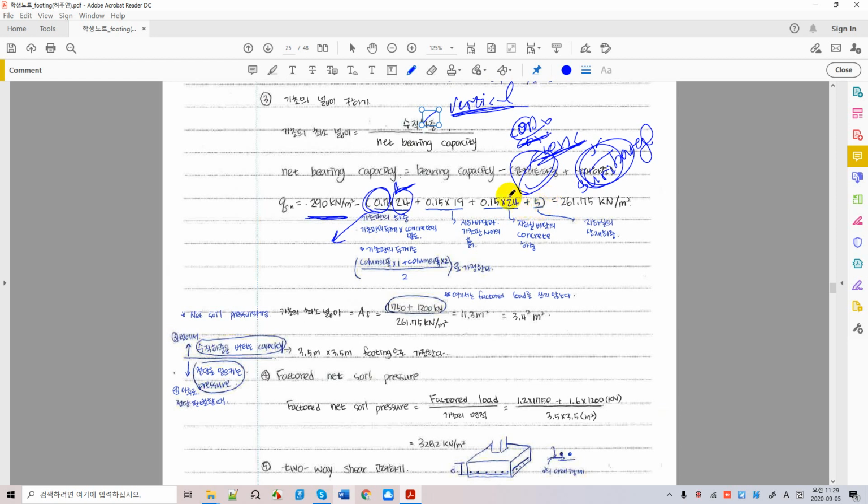And this is a concrete loading slab on foundations. So 15 centimeters. This is concrete foundation on basement. And this is soil packed on top of foundations. And this is surcharge, right? So this is 19 to take care of soil weight, and this is 24 to take care of concrete weight. So this is easy, isn't it? Bookkeeping, just try to follow, not missing anything, all right? And so your net allowable bearing pressure boils down to this value right there.